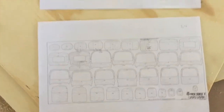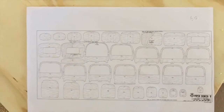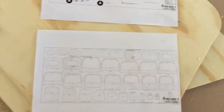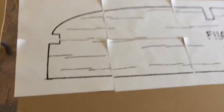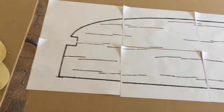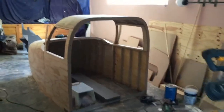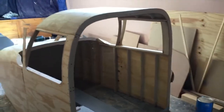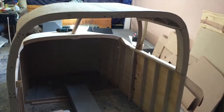So what I've done is I took these drawings of all the ribs and scaled them up 5.7 times the original size. Then I printed them out full size on lots of paper, stuck them to a piece of wood or MDF, and basically just cut around them to get the shape of the cockpit. So this one should be very accurate to the actual aircraft.